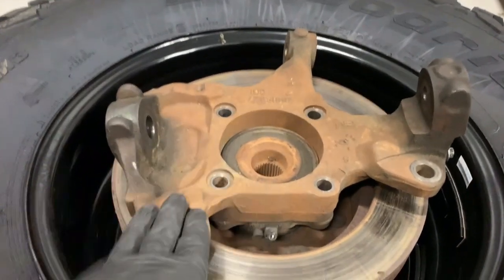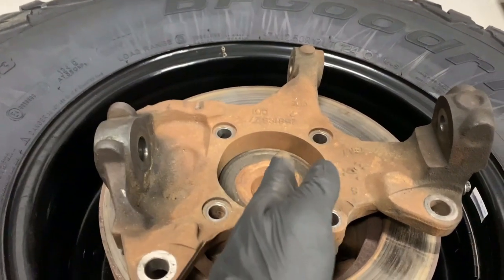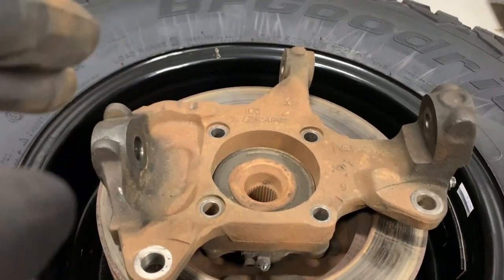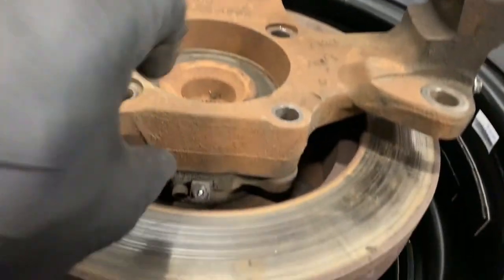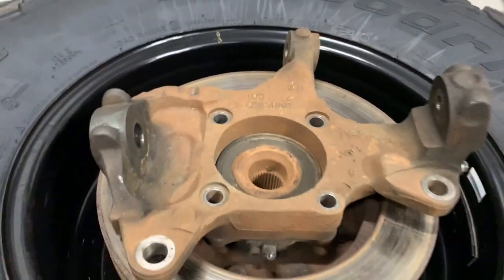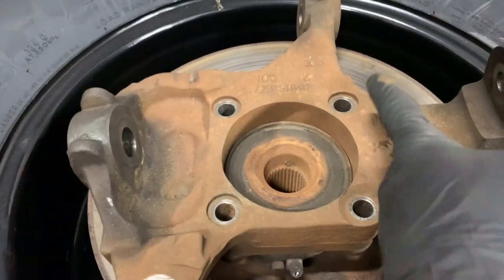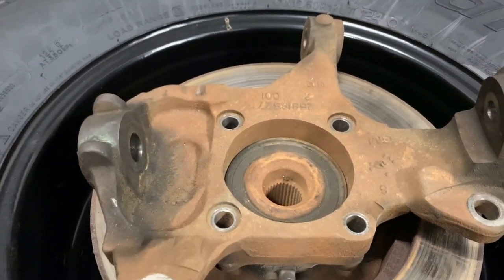Let's check out the spindle. The old spindle from the Chevy Silverado — the lower suspension arm mounted way down here. I'm planning on mounting it somewhere about the center of the hub, basically to give myself more clearance just based on the suspension geometry. So I'm not using the spindle; I'm going to chuck most of it. I still want to use the bearing, I still want to use the brakes. As I build my own spindle — the distance here is about two inches and the distance on the inside is about an inch. So I need about one inch of a spacer off of this.